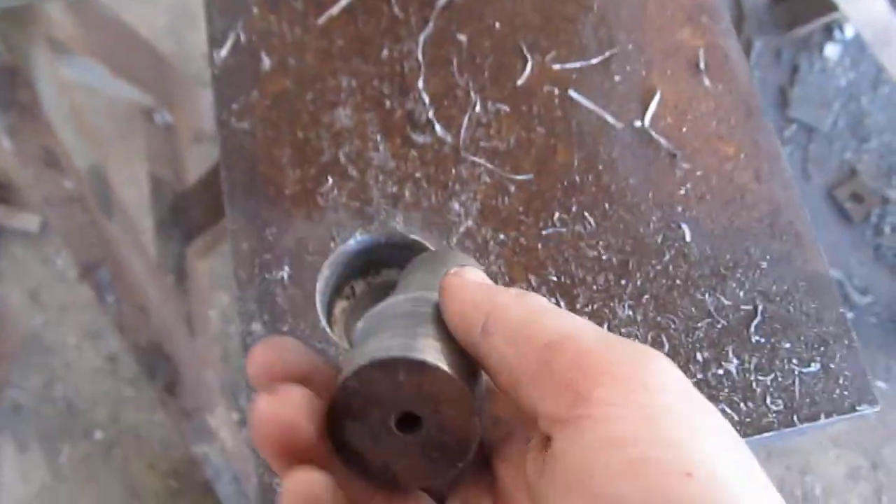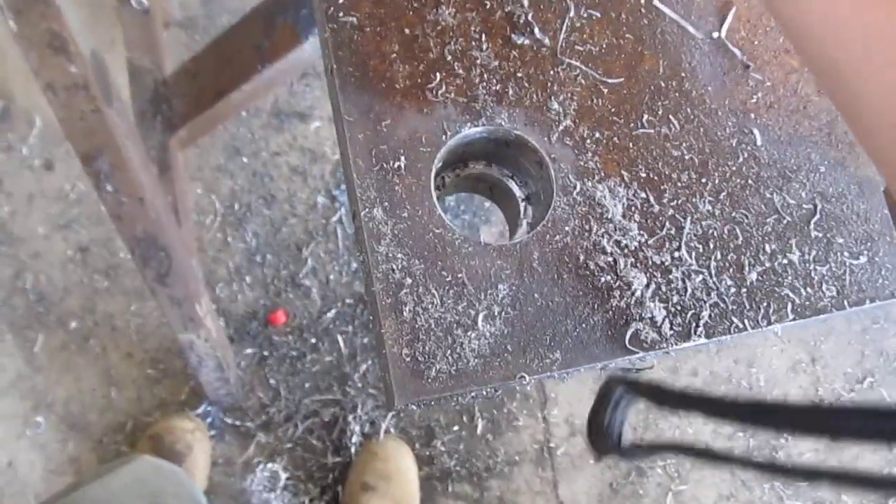Just make sure the mag drills coincide where the cutter is. So you cut that side out, and then you come from the other side with the bigger bit. And now that I've got the slug out, I'm just going to go all the way through with this bit and the extension I made a couple weeks ago.